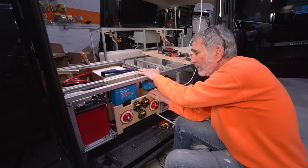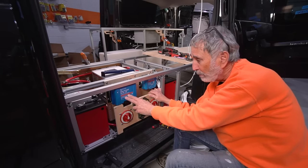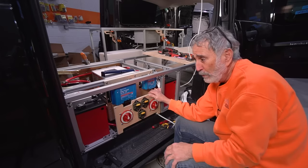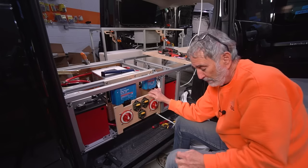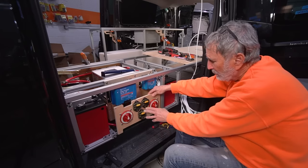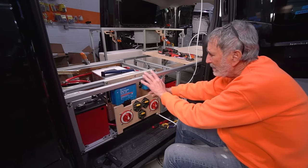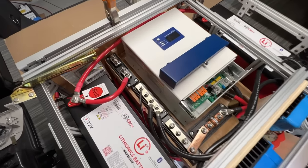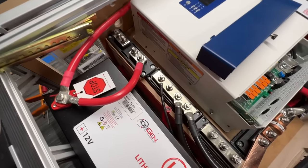It's all the other same accoutrement. We've got our Orion 30 amp charger while you're driving. You've got some solar on the roof, and then we have a nice shore power connection of 30 amps. But what I'm doing now, we've got shutoffs, we've got breakers, we've got all of these components that have to make nice together in an extremely compact area.